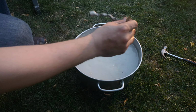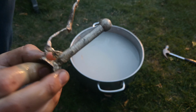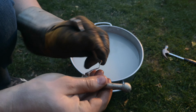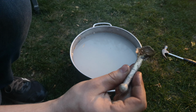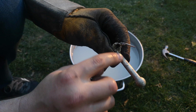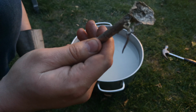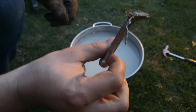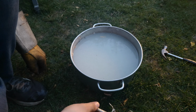I think, yeah, that's the one that I'm thinking is not too promising. That's actually, that's going to work, because I over lengthened it quite a bit. So it's almost an inch longer than it has to be. It's rough now, but this surface is going to be machined down, and I'm going to polish up the ball. And then this is likely the female threaded end, and the other one should be even longer and be the male threaded end.